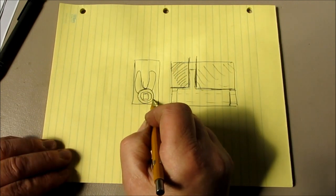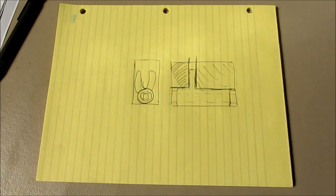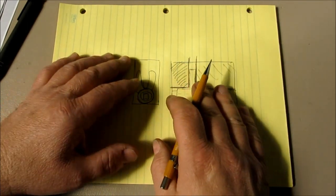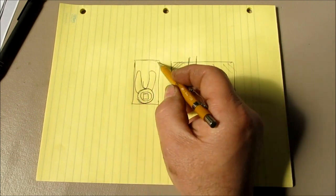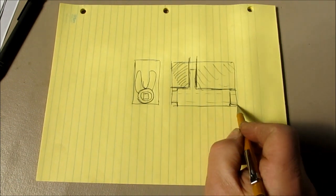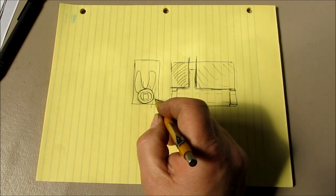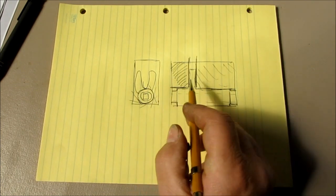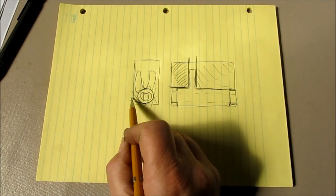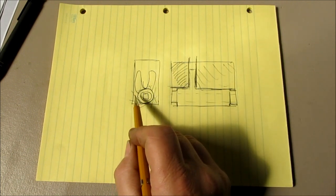And then what you can do is now make successive cuts along the cylindrical part. Now you would lay all this out on the block to start with, if that wasn't obvious, but I'll just say it just in case, okay? All right. And then you would just make successive saw cuts like so around this, down to this level, okay? So basically what you're doing is you're making a polygon out of that, down to this level, right? So this is basically kind of round, okay?